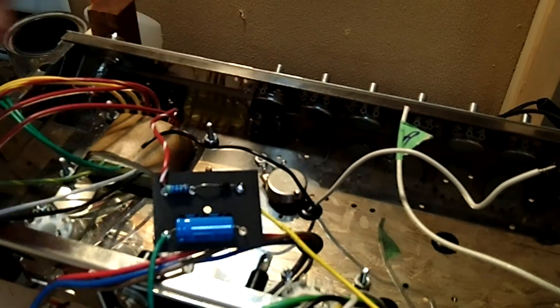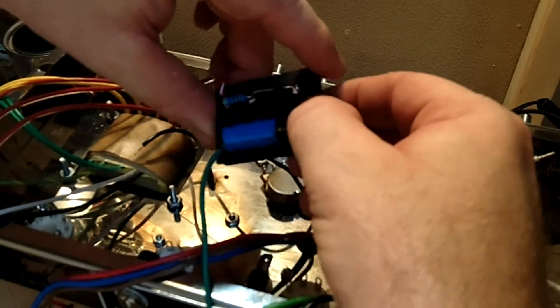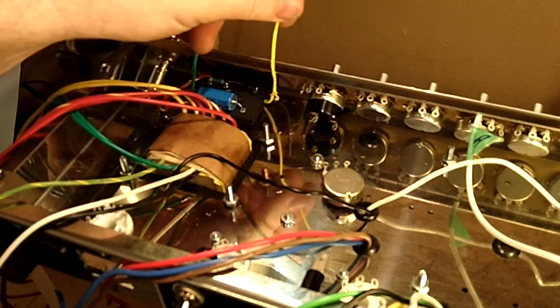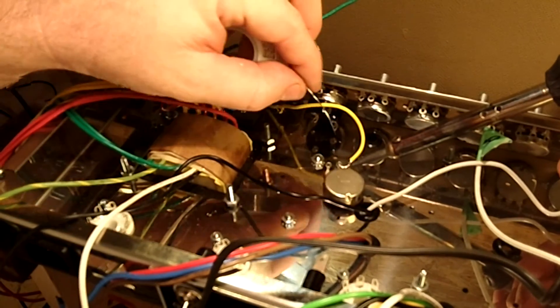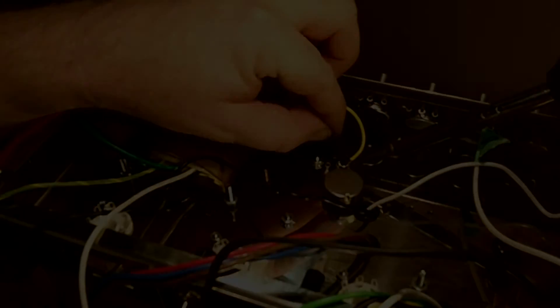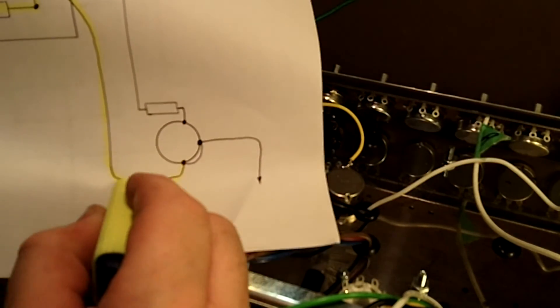Then put your backing fiber board back — this just keeps the wires on the back from making contact with the chassis. Mount that in place and you've got your ends that can go to the bias pot. We'll go ahead and make that connection now. You can see it actually connects to two of the posts on the pot, then highlight that in to confirm we've made that connection.